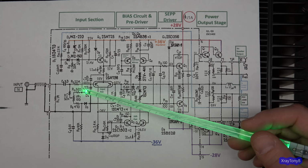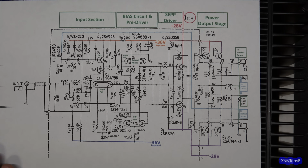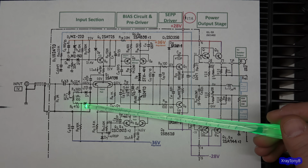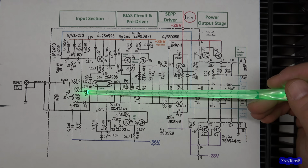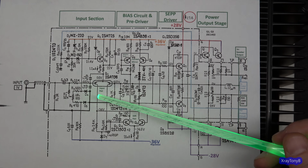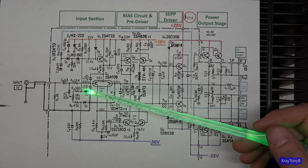In addition, this is kind of unique. You have this little offset protect circuit. So you have these 2, D4 and D5. And if you look at the service manual and look at the description of function, they talk a little bit about how these are thermally matched diodes. I don't think they meant they matched them on a curve tracer. It's just that they're the same type of diode and they will both have the same thermal coefficient. And the whole idea of that is the voltage drop across these will change with temperature a little bit, but they don't want that to happen, so they isolate them with a piece of foam, which is probably deteriorated by now. And these can be replaced with just a regular 1N4148 diode or something like that. The whole idea is you just want them to hold steady.